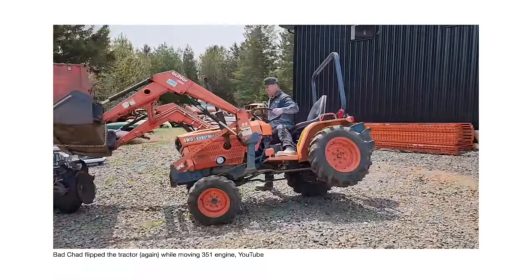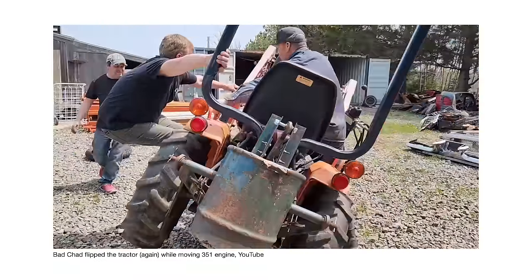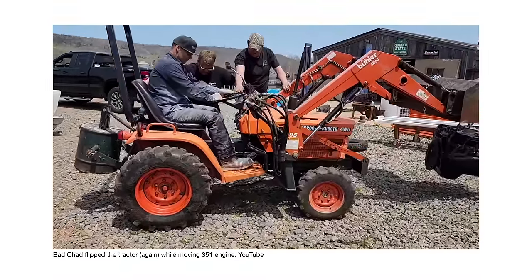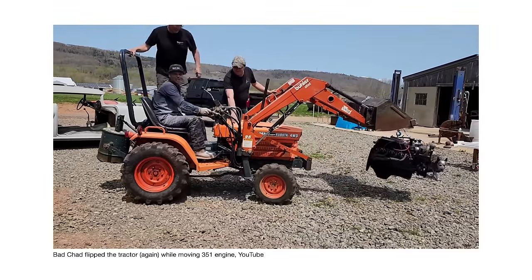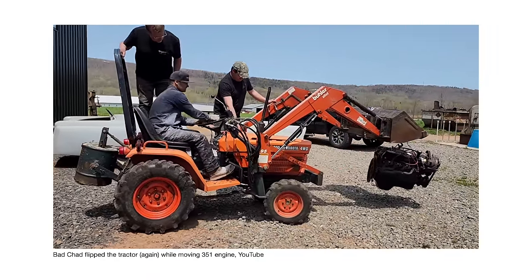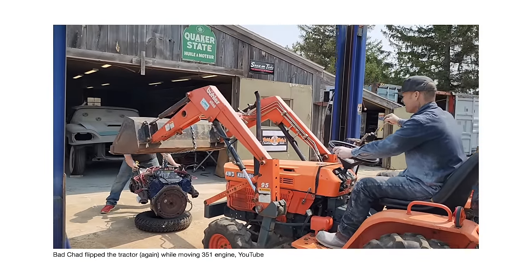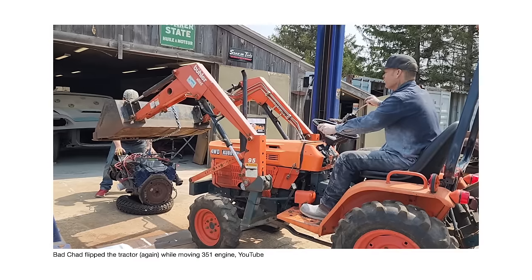Fortunately, you can see what happened here. The load shifted and the engine hit the ground, so that took off a lot of that force, a lot of that weight that was pulling it down, and so it didn't have far to drop. This tractor didn't completely tip over. It also helped with the fact that he's on perfectly level ground — there's no hills involved or deeper ruts or holes for him to fall into that could have completely flipped the tractor over. Something else to pay attention to is the fact that he does not have his seatbelt on, and he does have a ROPS bar that's up. In reality, you want to have your seatbelt on in this situation because it keeps you tucked in that operator station if you do roll over. He kind of climbs off the tractor, but if that tractor continued to roll over like it was on a hillside, the tractor would probably crush him because he'd be falling off on the low side and the tractor would then roll over on him.